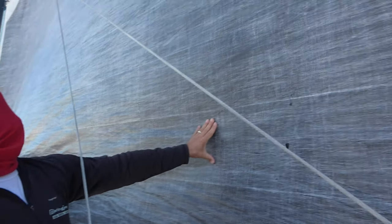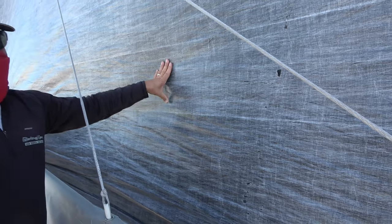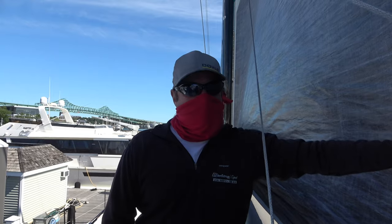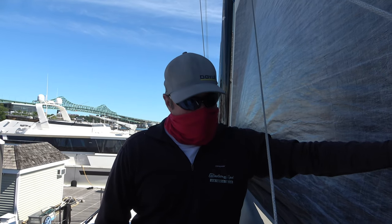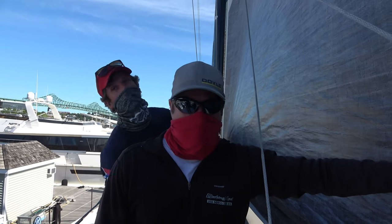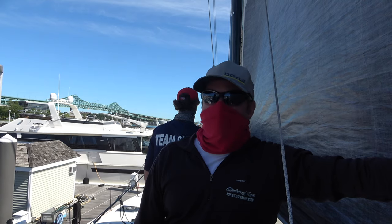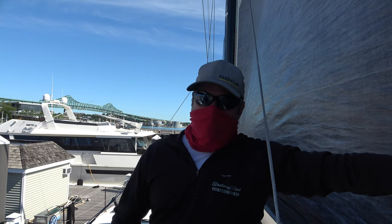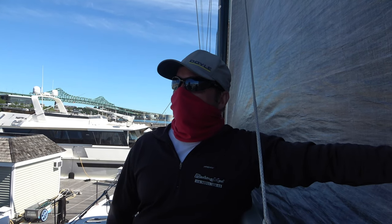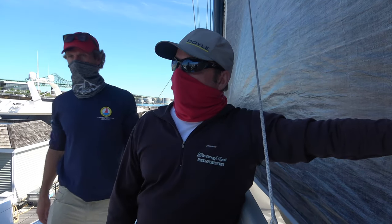But like I said, if we take it in, if you want, we can go over and dot the really big ones. It's just going to be with the sticky back, but that's at least what we've been doing. I don't know, you guys make good sails. I've had some of your sails in the past on produced boats, really a lot of the Gunboats and the HHs. And all of those we've done just with taffetas. We don't do anything with a film. It's just not worth it. Even the race sails, it's not that big a weight difference.